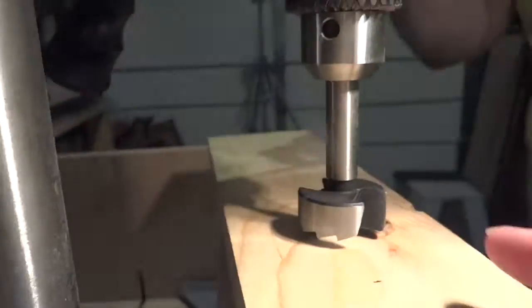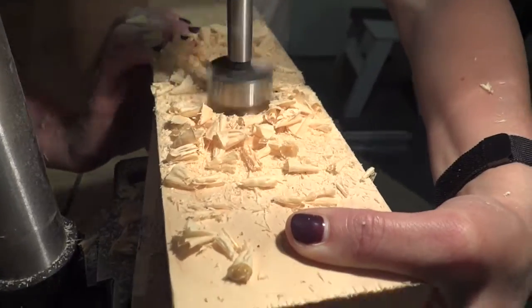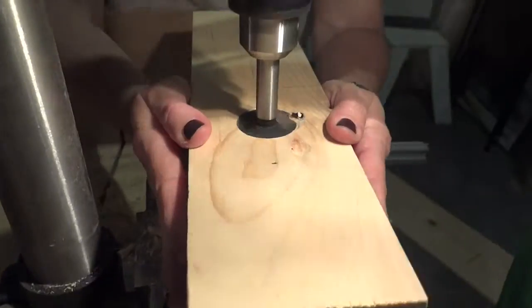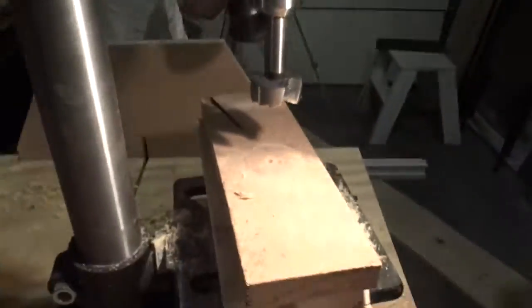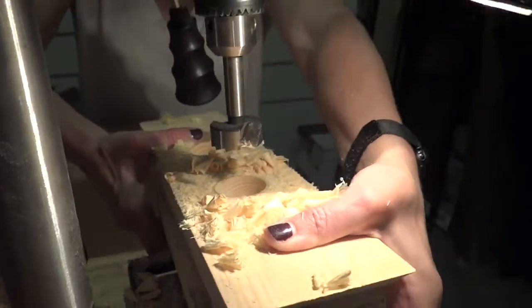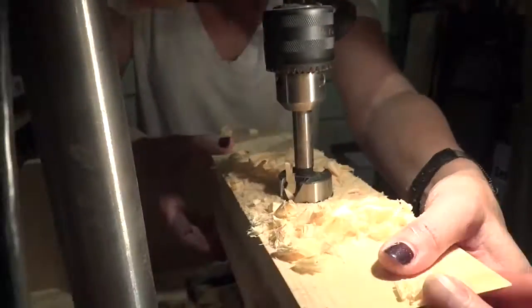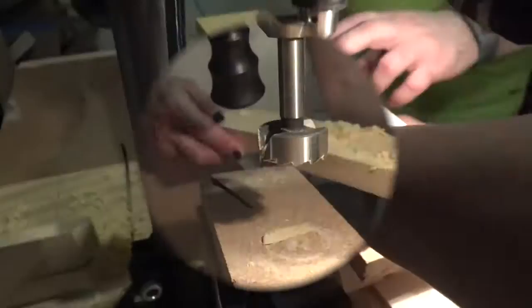We are speeding up this point because it is repetitive, and once we took measurements for the first one, as you are going to see here, we are using the first one to make the holes for the other 2 pieces. That way we ensure that they are all identical and we avoid the pain and anguish of measuring. I do not like measuring, as you're aware of, and the clip before just demonstrated why. It's very easy to make mistakes, and using one piece to decide the dimension of similar pieces is actually far more accurate, far easier, and makes a lot more sense.